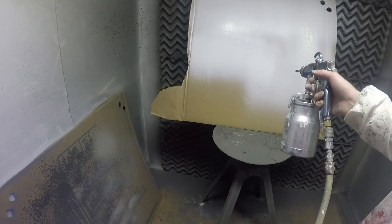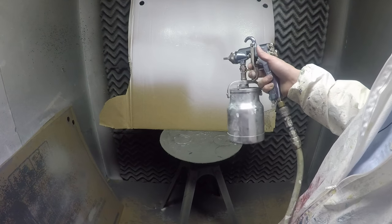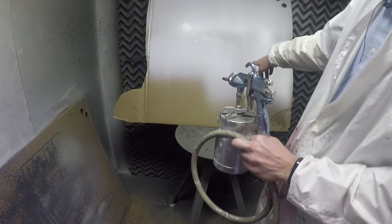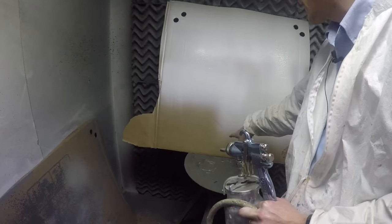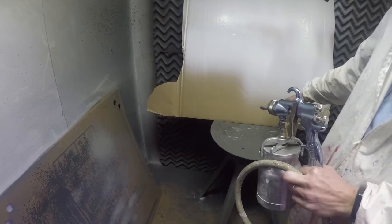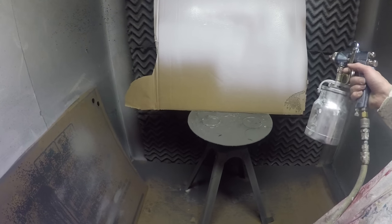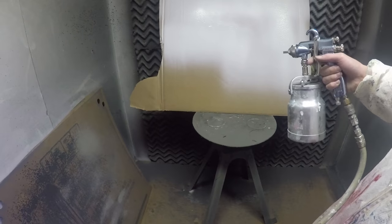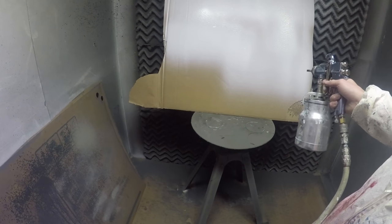With compressed air, I can give it more pressure, which causes greater breakup or finer atomization. This is from when I used the turbine. This is from the spray gun. At the edge of the pattern, you can see there's a little bit of a finer breakup. Obviously, you can get a similar result if you were to thin the turbine material, but with a compressor you're going to get a little more ability to deliver power in the form of air to your paint, and that creates an opportunity for better breakup.